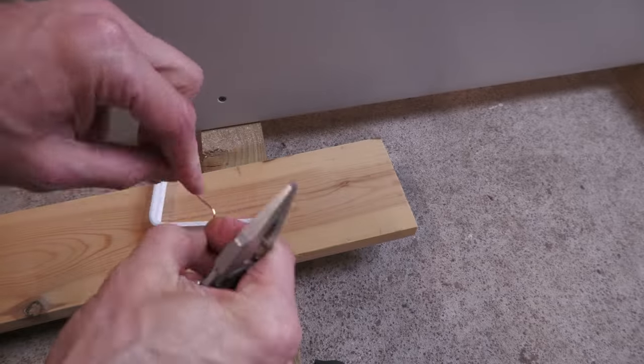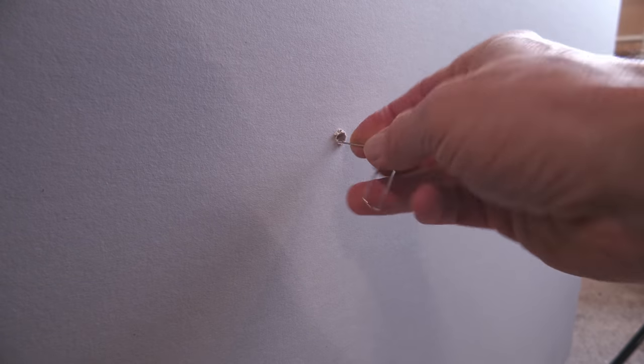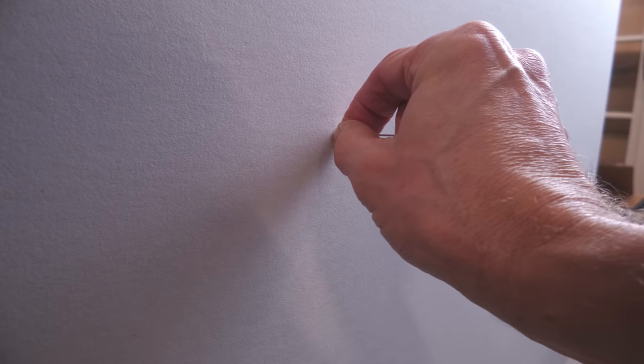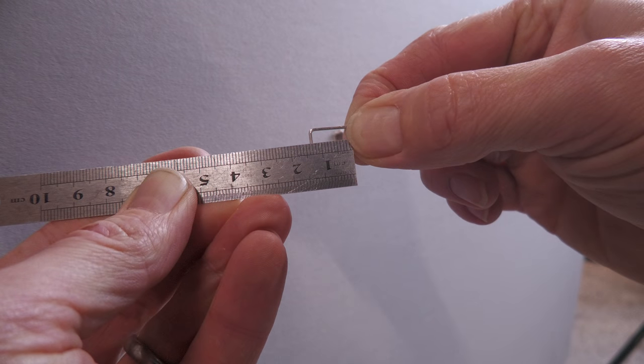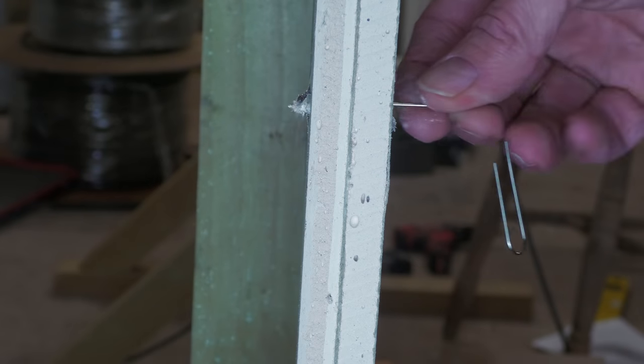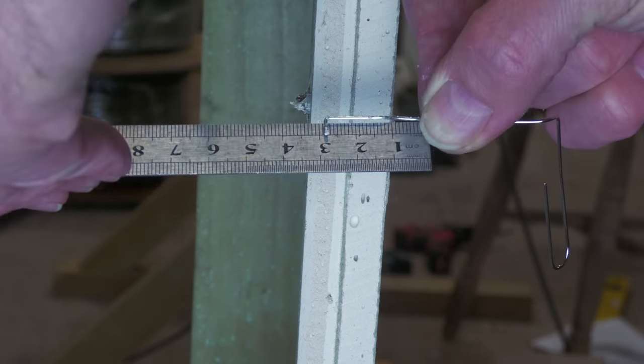There's a quick trick to find out how thick your plasterboard is — a question I get asked a lot. Bend over a piece of wire — a paper clip is ideal — poke it into the hole, pull it tight against the back of the plasterboard, pinch the wire with your finger and take it out. Measure that gap and that is your plasterboard thickness. More often than not it'll be a standard 12mm perhaps with a couple of millimetres of plaster skim on top, but occasionally builders double up the plasterboard giving a combined thickness of around 26 millimetres once the skim is accounted for.